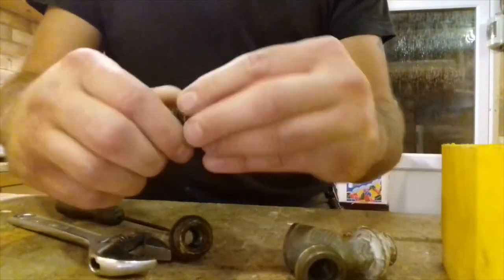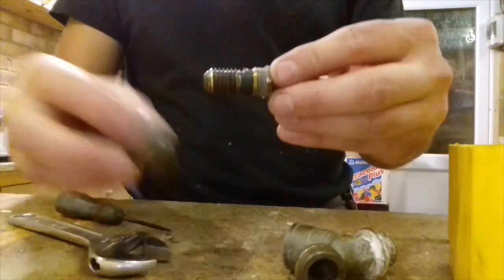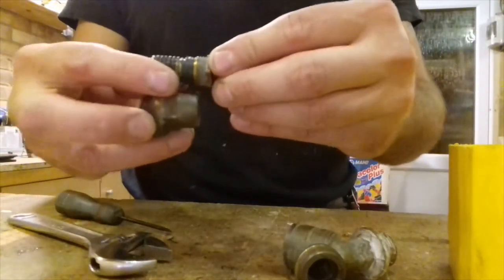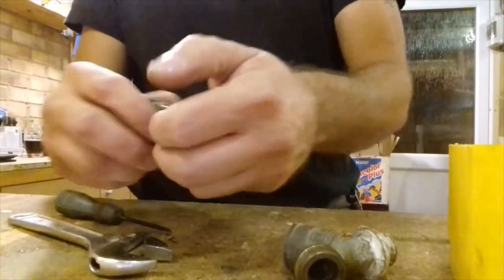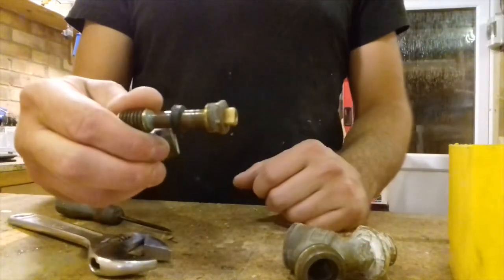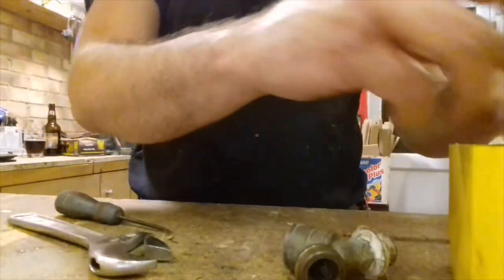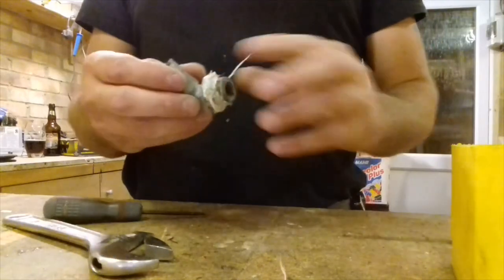Giggity. And then that bit over there which compresses, I compress it all together, which basically stops it leaking, and that's the thing that causes the issue. So by putting two turns of PTFE tape on that, it stops it leaking. Not always, but most of the time. So here we are.